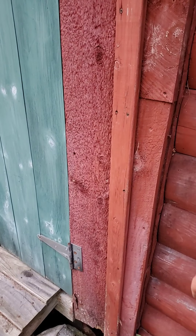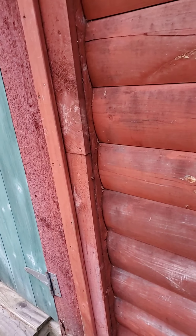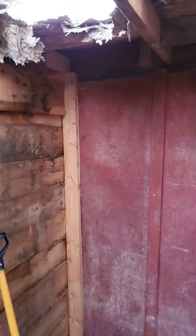So that would explain the damage I found inside this corner. I was thinking I needed help to come all the way out here to get this off because I didn't look at it close enough. I removed this board and this one — yeah, definitely this one is still not on there right. I have to run a couple screws in. The stud underneath had moisture damage and insect damage, so that's not good.